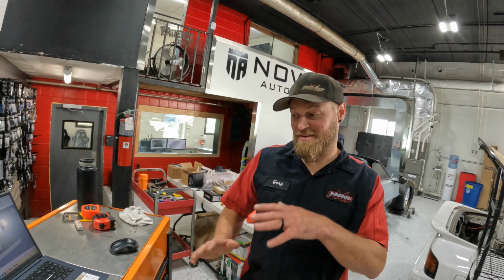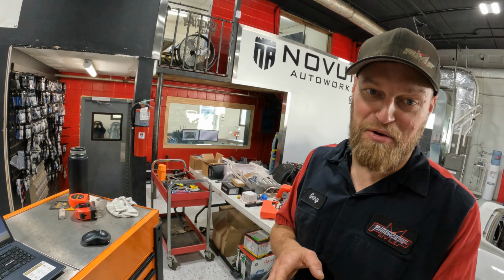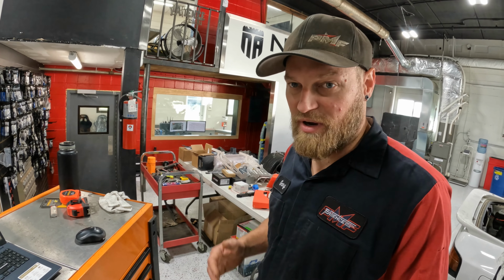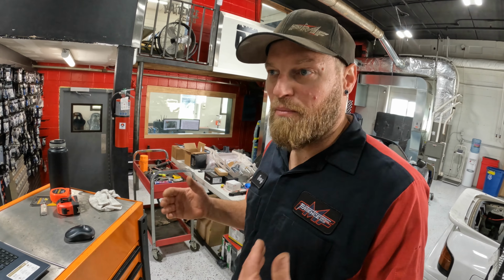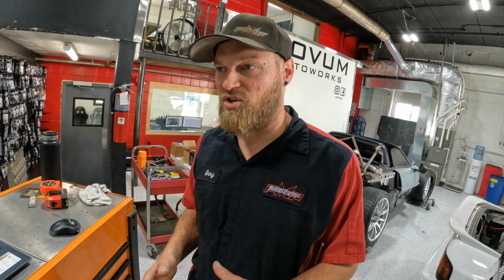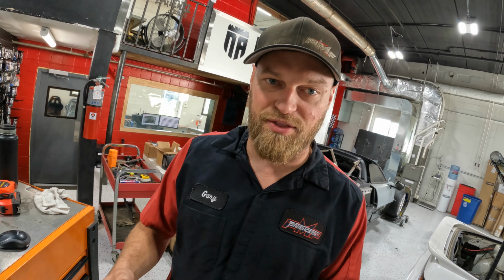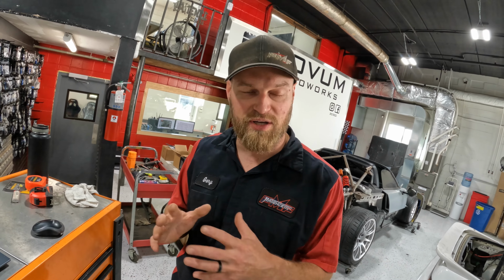Yeah, so, and this isn't even the end of it, right? I mean, it's a real back and forth process. RZR comes in, scan it, model it, design the cage, build the cage on an actual RZR, in this case an XP Pro, make sure that all the tubing fits the car the way it's supposed to, build one fully welded together, proof of concept. Second one goes together on the car, is only tacked, so we account for any shrinkage that the weld is gonna have.